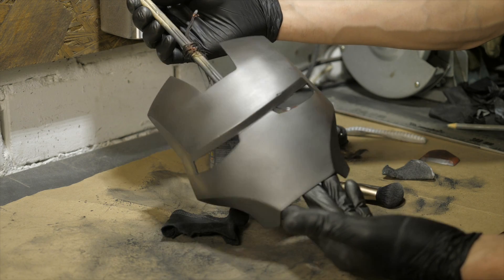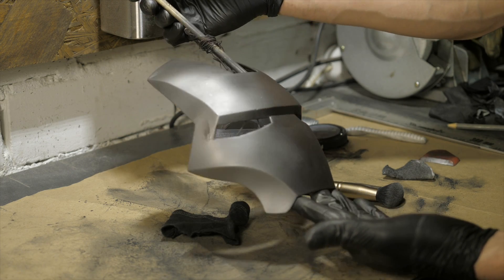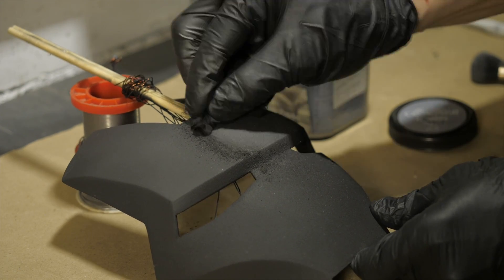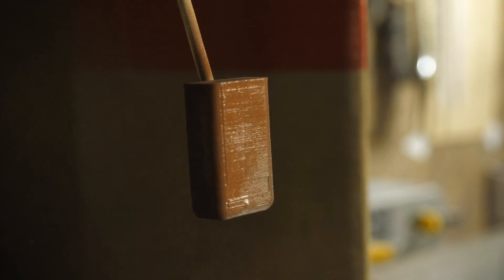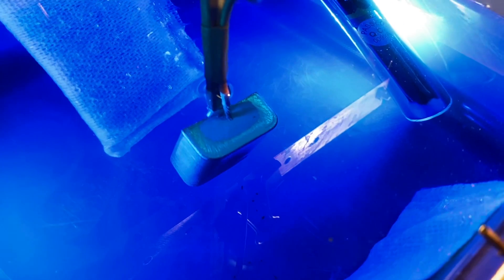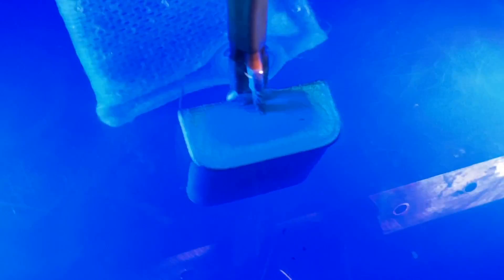All these nuances are especially important given the still high resistance of the graphite surface, which can be lowered several times through tricks with varnish and powder, though certainly not as low as copper conductive paint. With an electrically conductive layer of copper paint, these nuances are not so critical since copper will grow faster and more evenly with almost any arrangement of the anode plates.